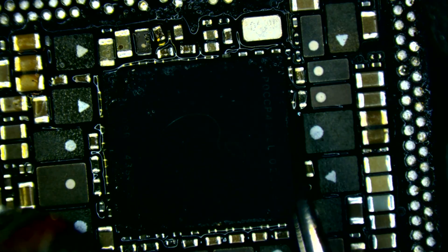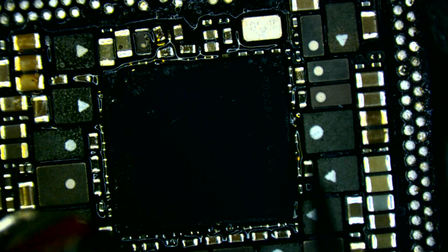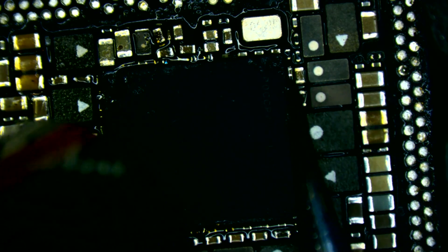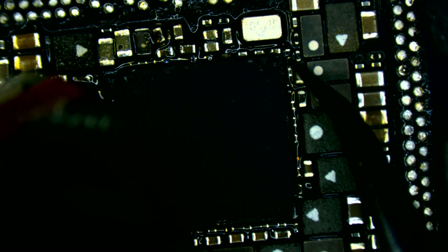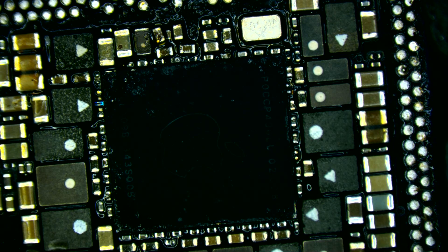Make sure you have the orientation of the IC in the correct position. When you get it up to temperature, you'll be able to nudge the IC gently to make sure it snaps into place, while also making sure any components that are still out of whack get snapped into place as well. Those are some of the tips and tricks I have for reballing a larger IC like this.